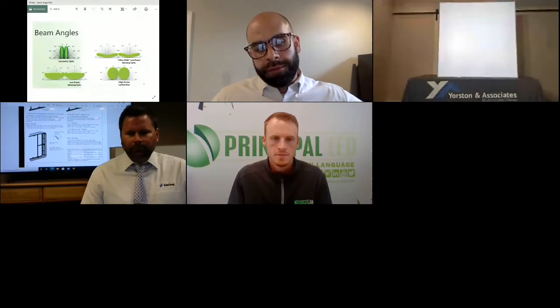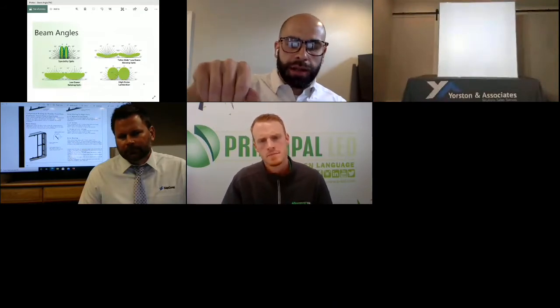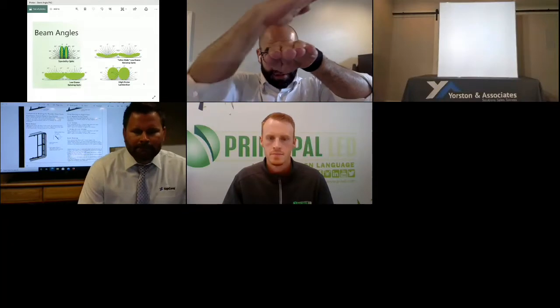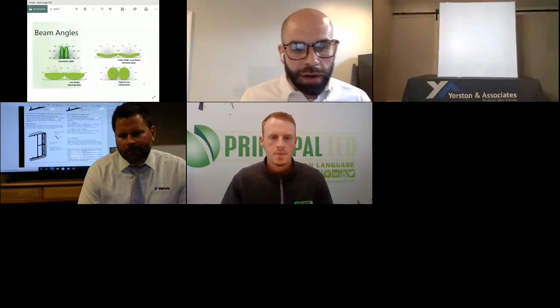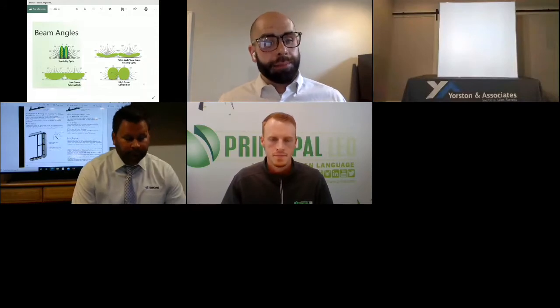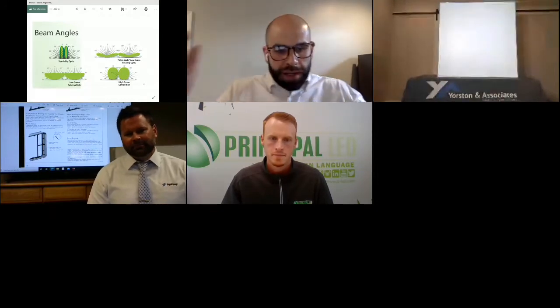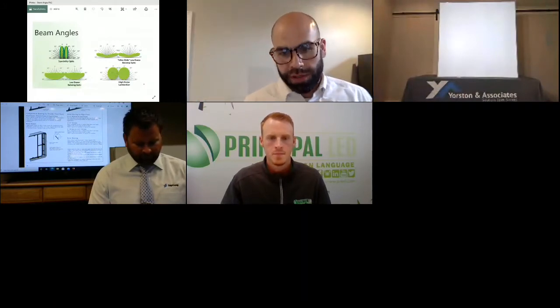So hypothetically, if you have an 8-inch deep cabinet and that frame brace is almost dead center, a lot of times you can put that module directly behind the frame brace because all the light is going to the sides, and then vice versa. The next row, if this is my frame brace, the light's going to go in front of it. So the one under is going here and here, the one beside it is going here, the one beside that is going over there. So light surrounds the frame brace and nothing's ever reflecting off of it, and it's never blocking anything. Again, that's really a variable depending on the depth. With something shallower, you're going to have to get that frame brace in a sweet spot in between so the beam angles can go over top. But in a deeper application, you just want to be under it and wrap that frame brace.